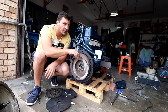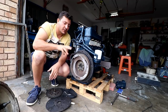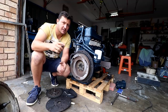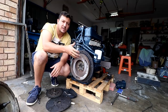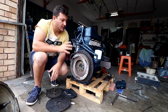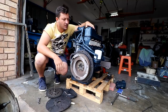All the Volvo 270s originally came with a V6 inboard motor drive putting up a few hundred horsepower, so power-wise we don't have a problem. We just need to make sure the blade tips aren't cavitating — cavitation starts at roughly 100 miles per hour on the blade tips. We're well below that because it's a low-revving diesel and we'll be cruising at around 2,000 RPM. We'll also have a stainless steel water-cooled exhaust manifold to reduce heat in the engine cabin area.